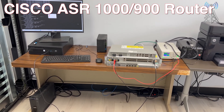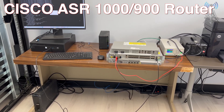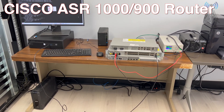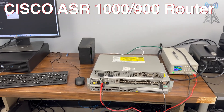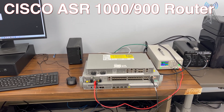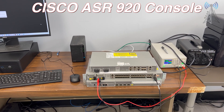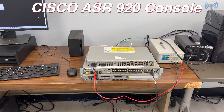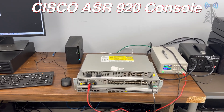Good morning folks, today we are going to talk about Cisco service aggregation routers — these are Cisco ASR 900 series, specifically the 920, and also the ASR 1001. As you see, the 900 series is mostly being used for telco services. It can be used anywhere, but mostly here it's being used for telco services. We have 48-volt DC power on them, and you can see the power supplies getting up, and the 1001 is a higher-capacity 10-gig service aggregation router.